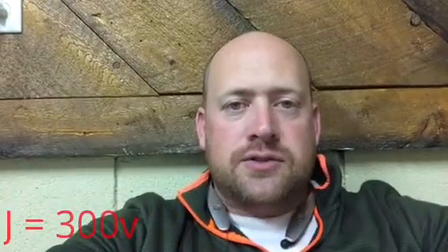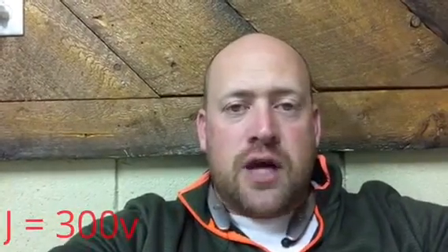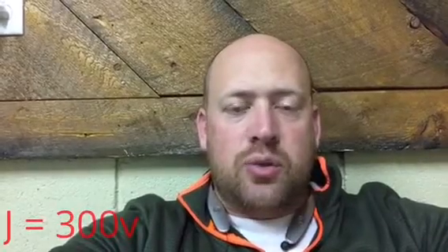So the difference is the letter J. The first letter stands for service cable. This is a service cable that is going to be rated at either 600 volts or 300 volts. That's where the second letter comes into play. The J in an SJ stands for junior service cable, and that's what designates the 300 volts.